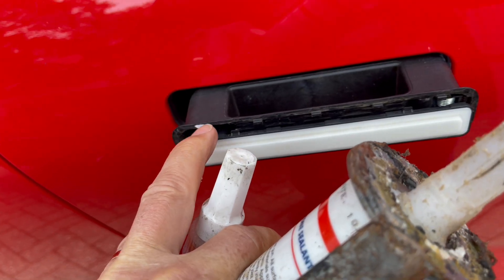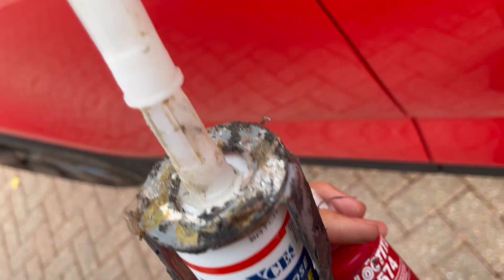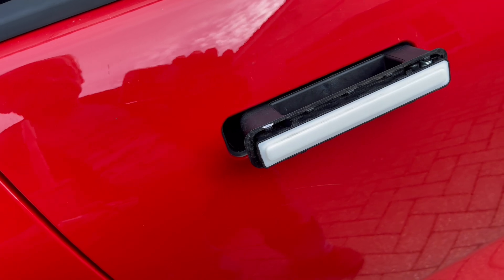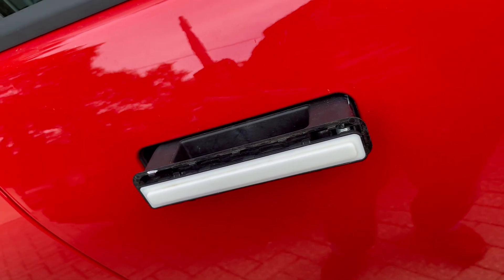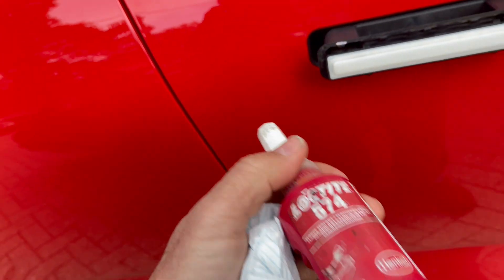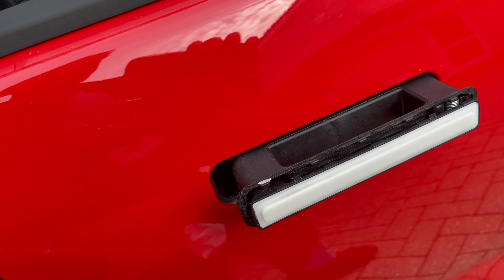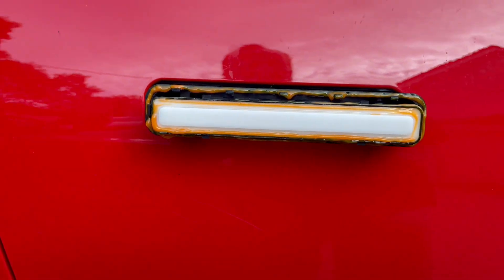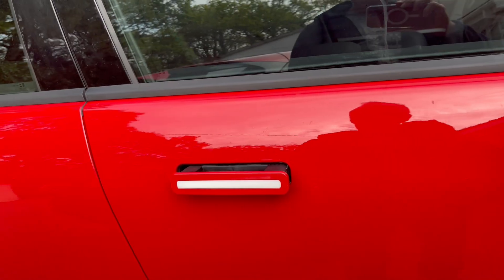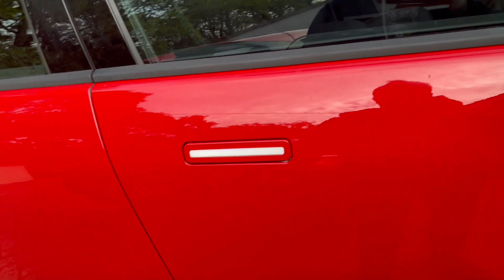Before putting on the top cover I want to make sure water doesn't get in again. I think I saw a gasket underneath this cover but a little bit of water was getting through the gap, so I want to seal on top of that — sealing between the top cover and the light cover and also around the edge. I'm going to go for Loctite 574, which is workable up until it sets in the absence of oxygen. Cover back on — and now hopefully the job's finished. Yes, all good, all working well.